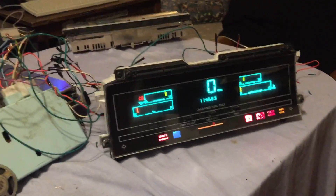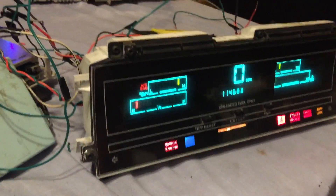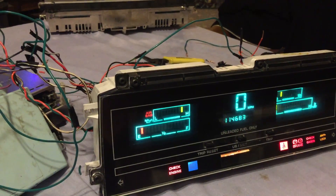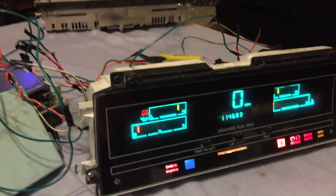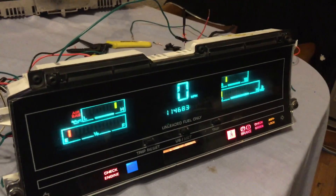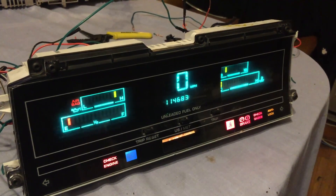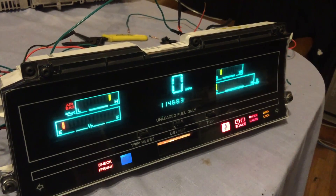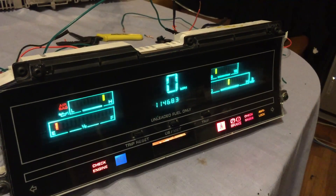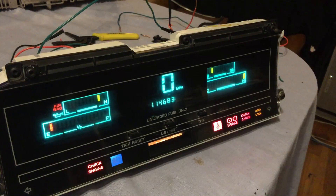Can't make a video without something going wrong. Anyway — I believe it takes 45 seconds from the time it's grounded and it senses that it's overheating for it to actually give us the audible message. So let's go ahead and push those wires together and we'll count the flashes, because the flashes on the warning symbols seem to go at one second intervals. Starting right now — one, two, three, four, five, six, seven, eight, nine, ten...